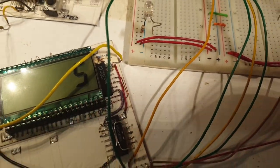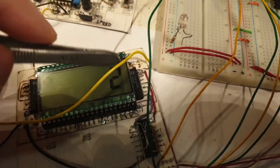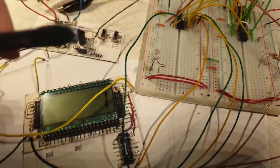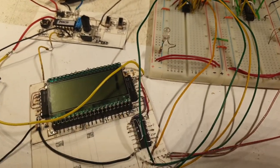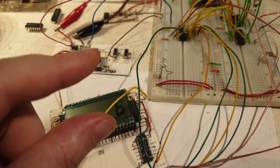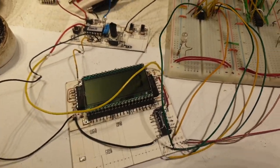I did encounter a very slight error when I first put this chip in — this pin for the A segment was out and the segment wasn't lit at all. I tracked it down, figured it out, and checked every wire and connection. In the end it was a pin springing out — not making any contact. It looked fine visually, but when I pressed it I could see it moving. That was it.